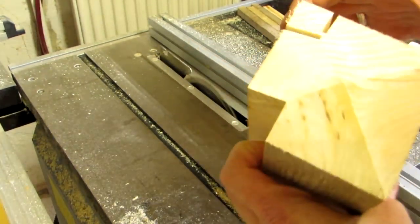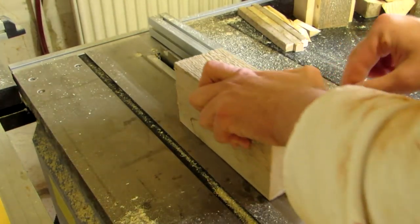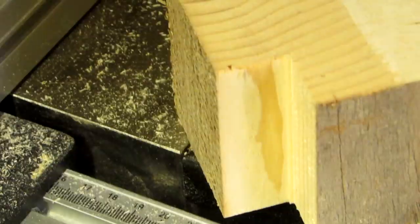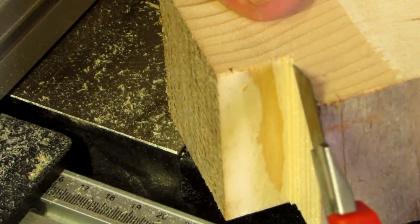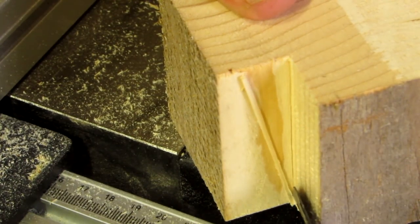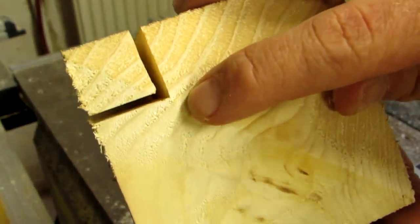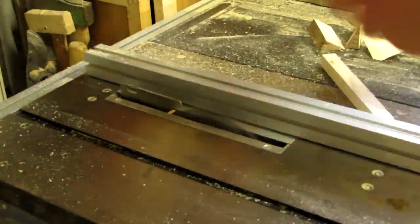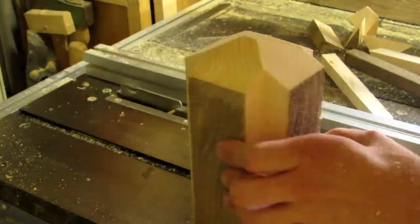You can use the cut for reference, but do not go too high. Repeat the test cut on the same corner to see how well it fits. If the cuts intersect and the piece comes out, you are not quite done yet, because you also need the inside corner to be crisp. You can remove the little ridge — the outside edge within the inside edge — with a knife or a chisel, but the knife was quicker for me. It will be easier to raise the blade just a little further to eliminate that ridge. Now repeat these cuts on all four corners and set the four pieces aside. If you make multiple lanterns with different widths for the columns, make sure to keep the matching pieces together.